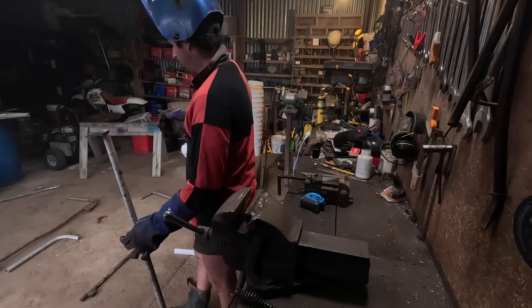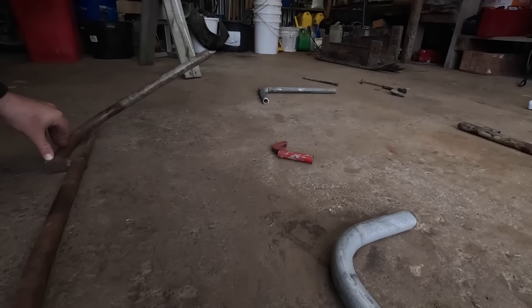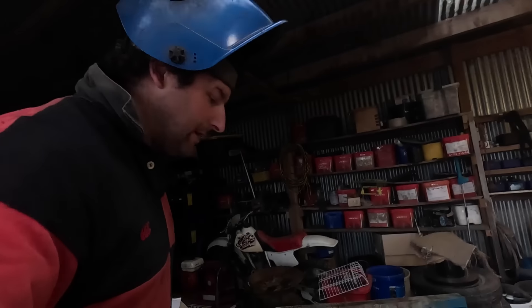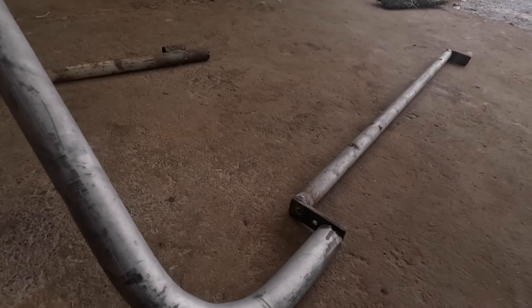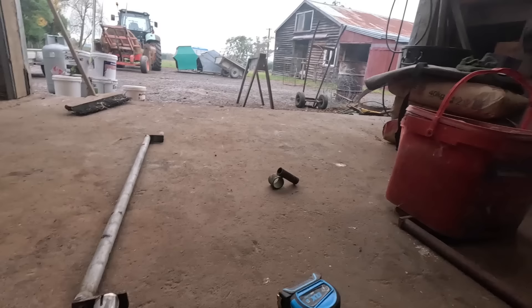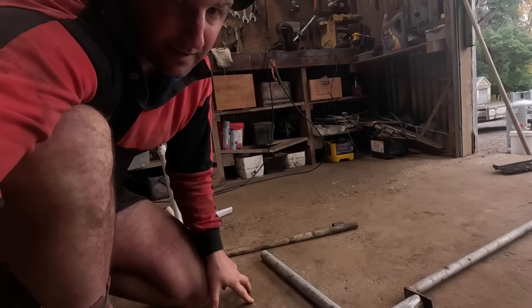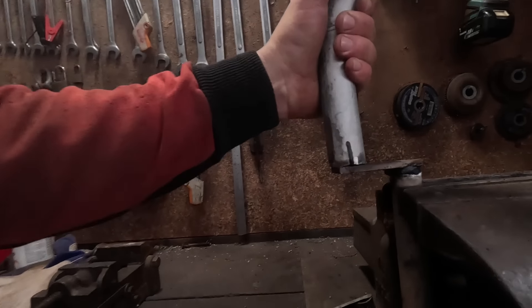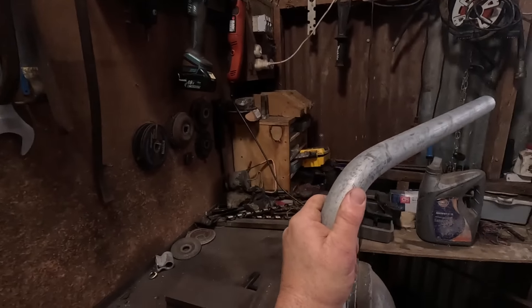The handle is probably the trickiest bit out of this whole design to get right. If we've got that sitting flat against the concrete, that is how high that top of the handle is off the ground. What I did to work out this offset - if we have this pipe sitting just like that on there, it's 260 mils between the bottom of that and the ground. So 260 mils is the offset you need to make the lever work and to make it self-lock when it's locked in the Taranaki gate. We've got that in the vice ready to weld - that's the offset mark there on the bottom.